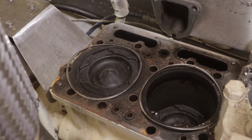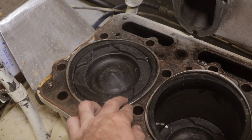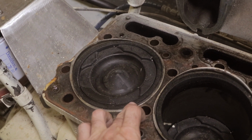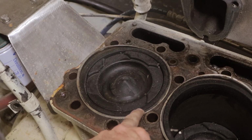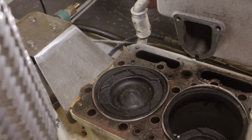So essentially, overheating a cylinder can end up with cracked pistons, can end up with more strain on those liners getting pounded down. There's a few other things that can happen, but the reason why I'm touching on those is it's exactly what's happened to Brupeg. When a truck came in with a blown head gasket, it was pretty standard that it was because these liners have been pushed down. And these circular shims here would get put on top of the liner like that, and then you put the head gasket back together, and you push the truck out the door and off you go again, and you're good to go.